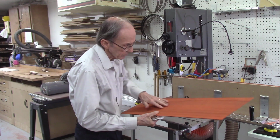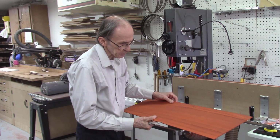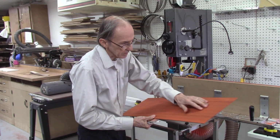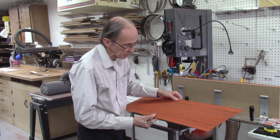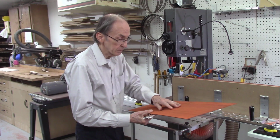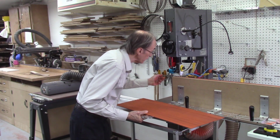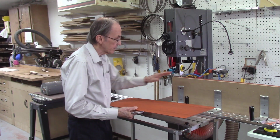Yeah, that smooths the board. It's a coarser finish than my 8 teeth per inch blade, which I would expect since it is a 3 or 4 teeth per inch blade. But this can just be run through a board sander to smooth this out. It'll be a fine finish. But I had no smoking of the blade. There's no gumming up of the blade. It's nice and clean, and it did seem to run quieter.